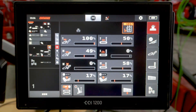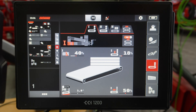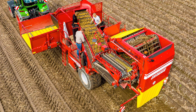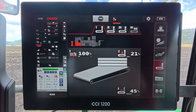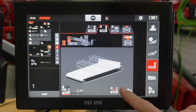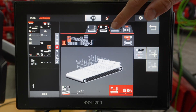Let's start with the settings for separation. Open the separator page on the control terminal and click on the finger separator at the top to adjust the settings. This guide uses a machine with two separators, such as the Evo 260 or 290. For a machine with three separators, like the Evo 280, the settings must be made on the third separator. Set the speed of the hedgehog belt and the finger belts to about 50%.